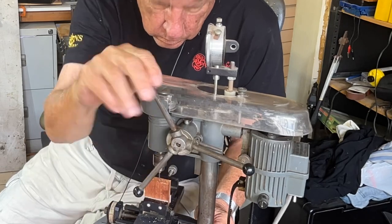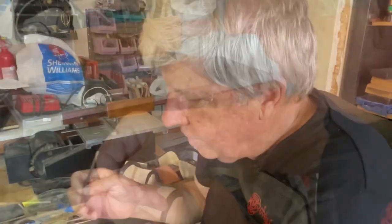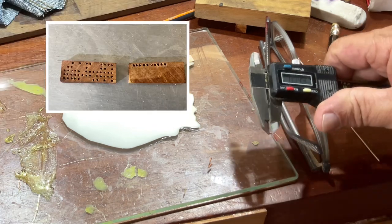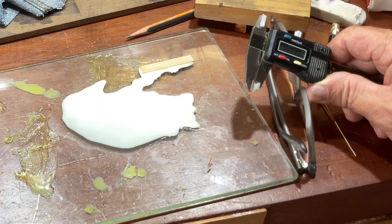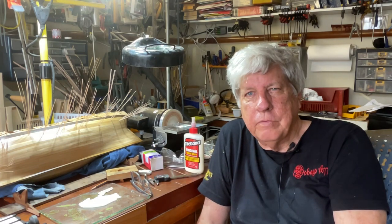Here they are — it went fairly easily. These are 0.43, so again about 2 inches. The little lesson I learned is that I only got 3 usable ones. The first 3 I did very, very slowly using the variable foot switch. Then I speeded it up and the second 3 just disintegrated. So clearly you have to keep the speed well below 1,000 RPM. It's a system — it works. I will try to get some smaller needles because that's clearly too big for this model. If it's productive, it'll be great.